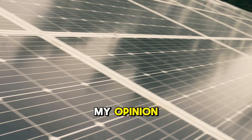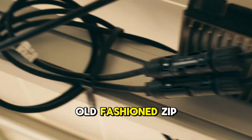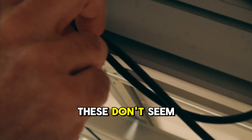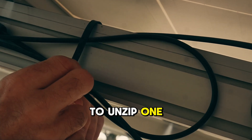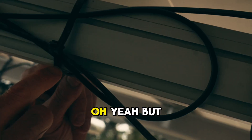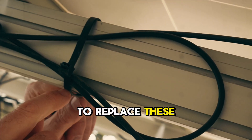This system — in my opinion, cable management was done sufficiently well. These were done with good old-fashioned zip ties, and that's not uncommon. These zip ties still look to be in pretty good condition; they don't seem like they're cracking. Though if you were to unzip one of these, that plastic will have that hard bend — that's what happens with oxidation. You could snap it. It looks well done and it can be maintained over the years if you need to replace these ties.